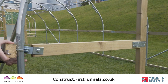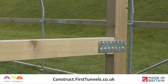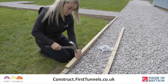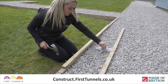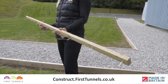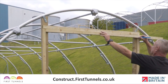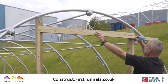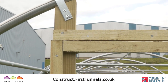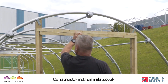Please note, the nail plate that attaches the corner rail to the door frame post will pivot enough to accommodate this. To help complete this process as quickly as possible, we recommend pre-nailing a number of battens. Ensure the nails do not protrude. Nails should be 10cm apart. Measure the length of batten that will be required to fit in between the inner edges of the doorpost, and cut a piece of batten 1cm short of this measurement to allow for clearance. Keep these close to hand.